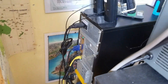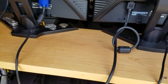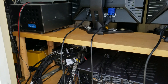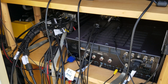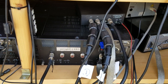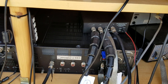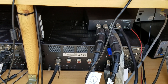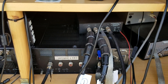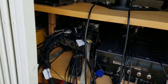You can actually buy from DX Engineering a filter called ISO Plus, but I've just gone into my pocket and put ferrite beads on the hub in the hall where the internet comes in. At Palomar you can actually buy little RFI units that plug into the radio as well. But it's money - Palomar is very good for RF bonding and grounding, especially for noise reduction.